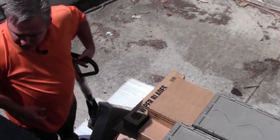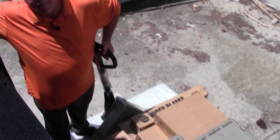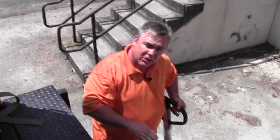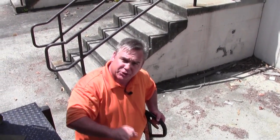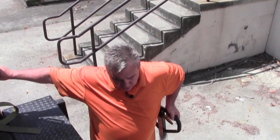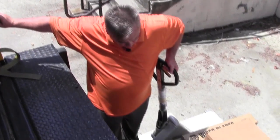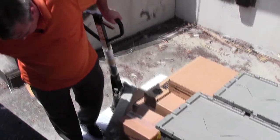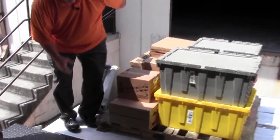You will stand back up on the liftgate again, ensuring that your toes are nowhere near the lip. You will press the button to raise the liftgate up. The reason you want to hold the button all the way down or all the way up without stopping is that if you release it halfway through, it's going to cause it to bounce — you want a smooth transition going down as well as up. So once the wheels are turned sideways, the pallet jack is lowered, the skid is in the middle, and the freight is secured, hold the button up, ensuring you're not too close to the edge.